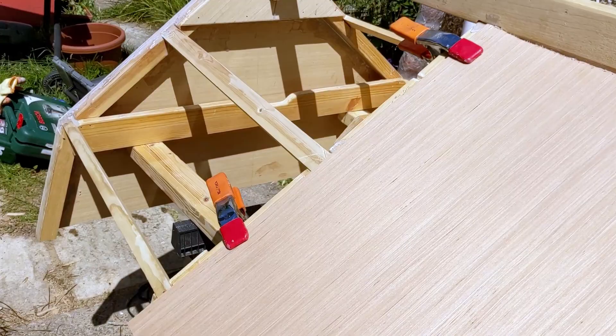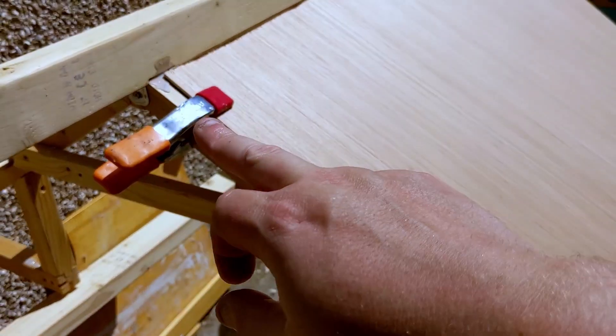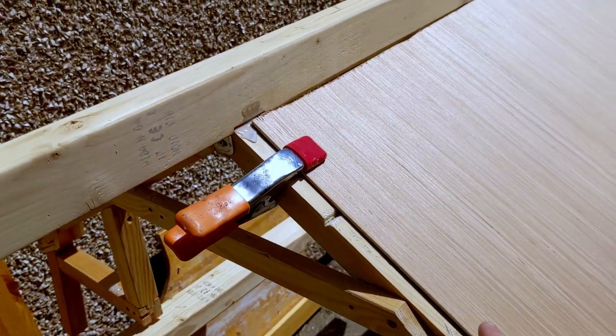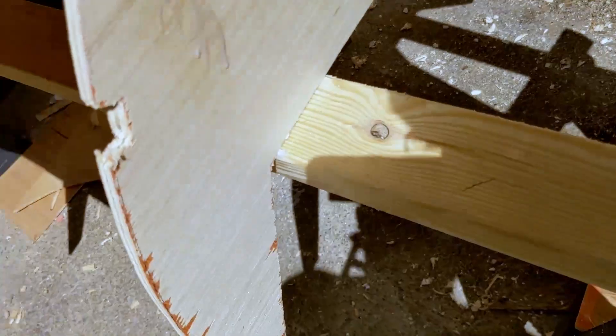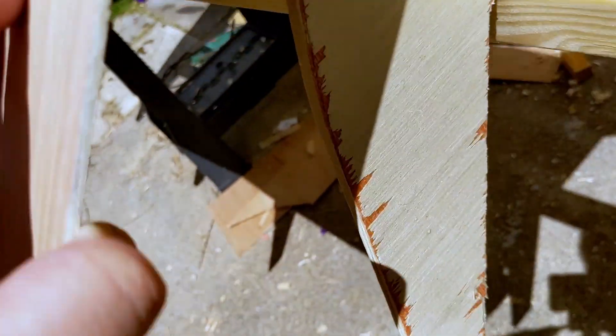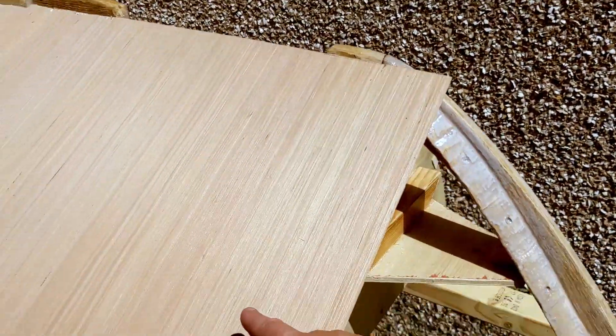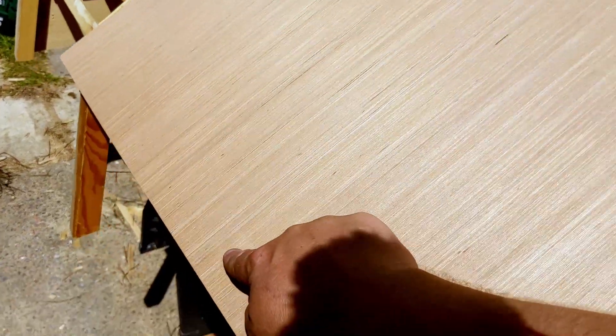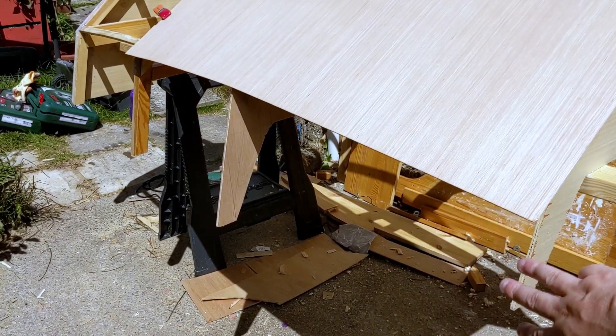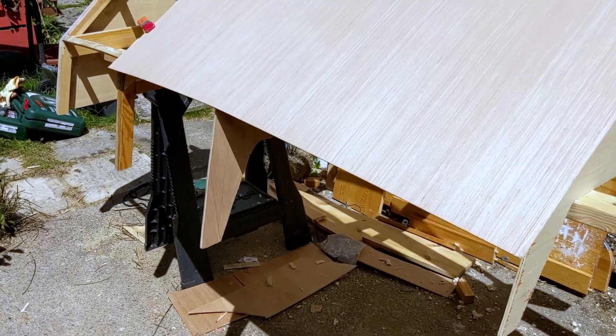I'm using a pair of clamps back here just to secure this in place. I will epoxy under here in this line, and towards the front I'm going to use a stitching glue technique where I'm putting ply to ply. This board I'm going to cut to that line to the quarter section, and I'm also going to cut it here along this bit. I'm going to wait on making a final decision about this line until I know the angle of the ply that's going to go there to form the sort of freeboard section.